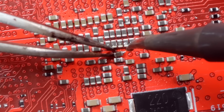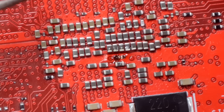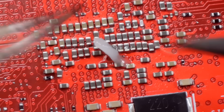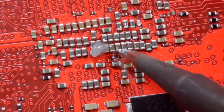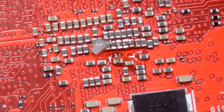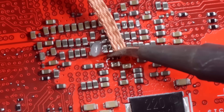It refuses to stick down. Let me try my larger iron — maybe if we bring a little bit more heat in here, that'll work. We've got to figure out what's going on with this board and why nothing's sticking. Bringing some more flux in. We accidentally soldered some pads together, so let's get some solder wick on here and wick enough of that up to get it out of there.